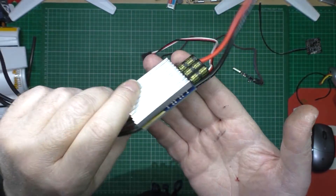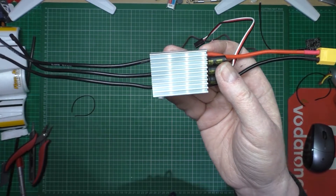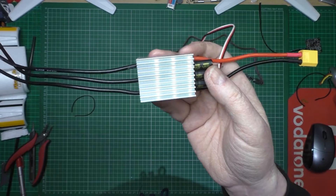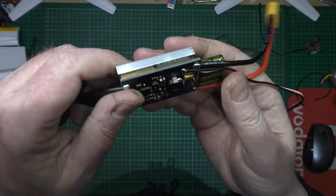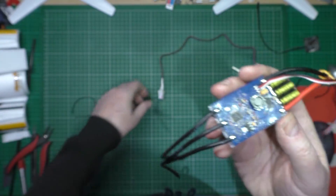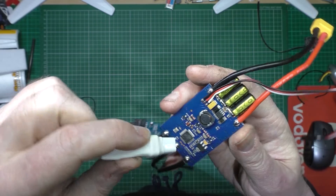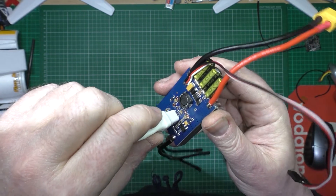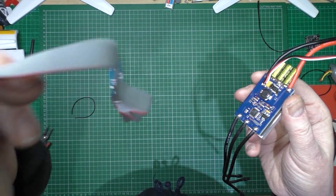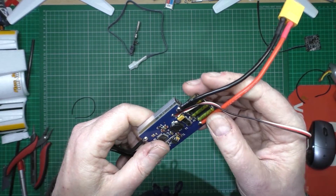This is the ESC that you get with the... Radjet! Anyway. I've noticed on here that it's the Atmel 8 chip, so I'm going to flash it — I always do — with my USB ASP and cable and everything. So I'm going to flash it with BLHeli.